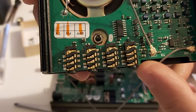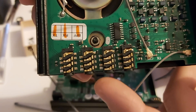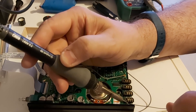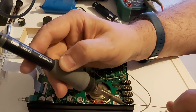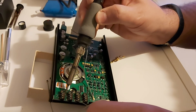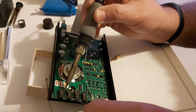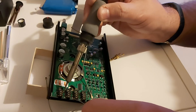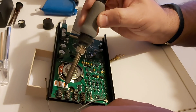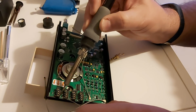On the logic board there are a lot of connectors with barely any solder on the pads — no surprise they'd come off. I'm going to reflow all of these solder pads because there's not enough solder. With enough mechanical stress they'll just pop out. Some of those pads have no solder on them whatsoever — they're just basically laying on the board. The jack is held in place by only a couple of solder points. It's crazy — it is done by machine, but a human should go over those joints, though of course that adds cost and time.